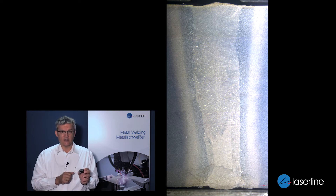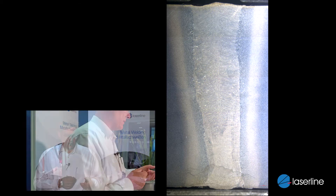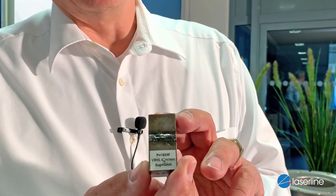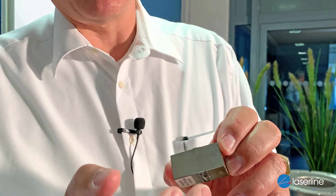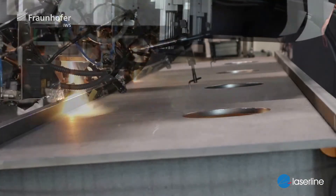In this short video we are taking you on a journey through different applications and materials. One more thing I want to show you: this material here is 20 millimeters thick, and we welded it with our diode lasers — from two sides, because the melt pool would simply fall through with a one-sided application. That's a 16kW laser doing this weld. Here you see the cross-section from both sides — top and bottom. We typically weld in the PC position, creating thicknesses joined by lasers used in bridges, steel constructions, and pressure vessels.